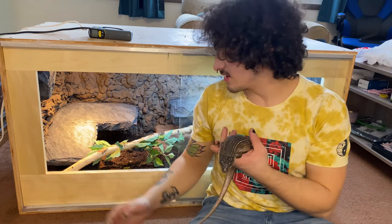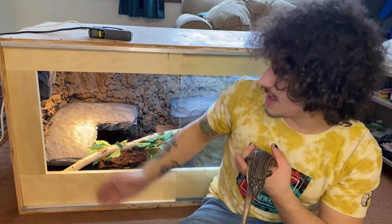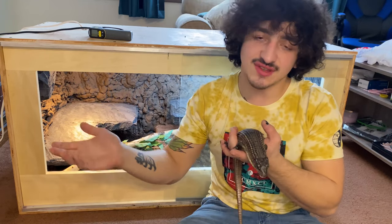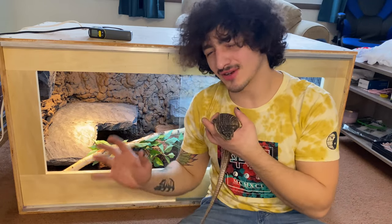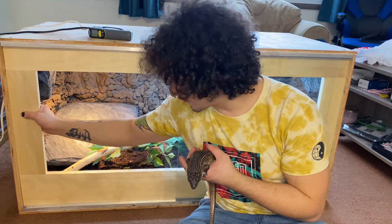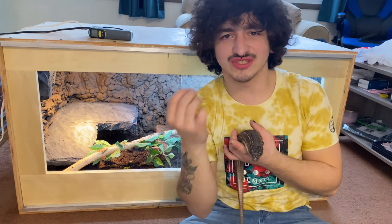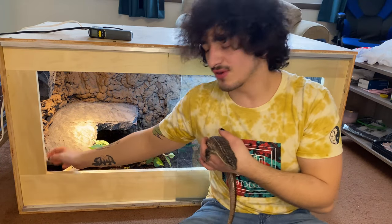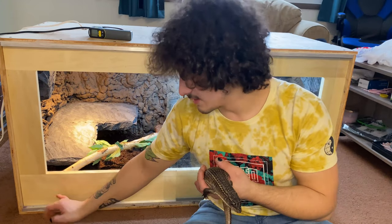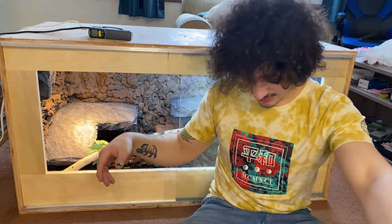In the meantime, we put this door frame together. As you can see, this isn't plywood — it's a couple of other wood boards. This provided a little more structural integrity. Half-inch thick plywood can be strong, but this more hardwood frame, about three-quarters of an inch thick, gave us some nice sturdy rigidity. This was put together with pocket holes to screw these together, because the angle they're at would make it hard to get a screw up into the next piece. The pocket holes also help with structural integrity.